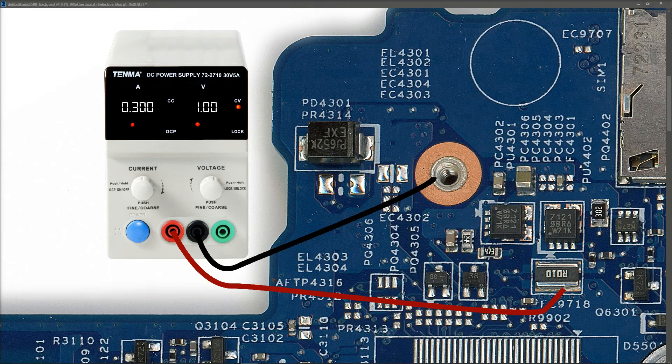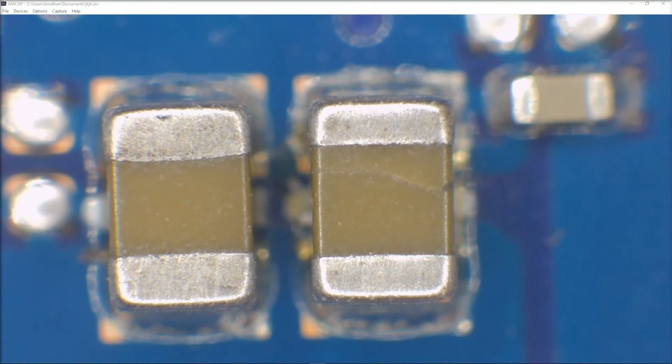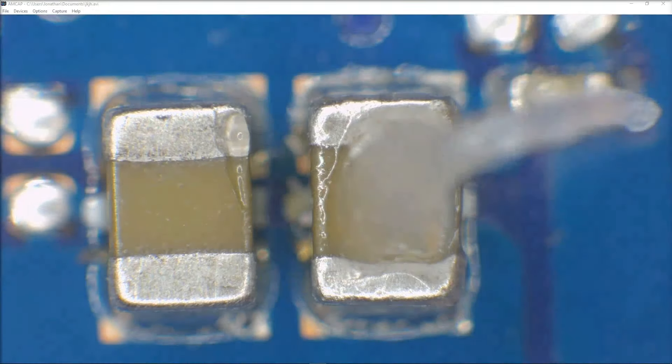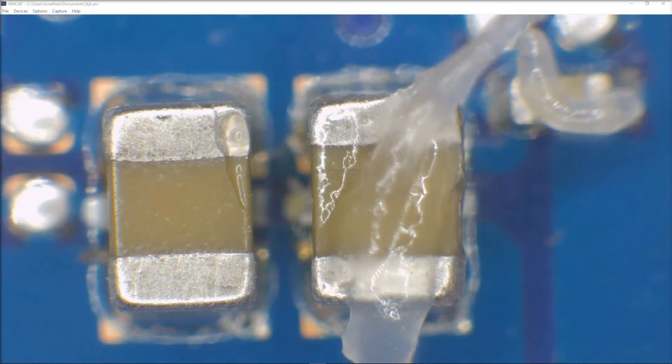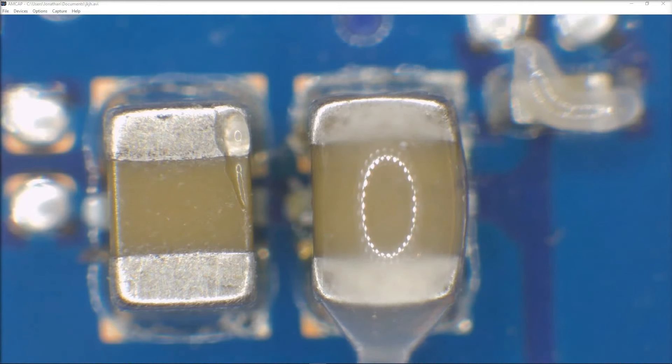When injecting that very small amount of power nothing heated up, so I slowly raised it bit by bit. When I injected 4 volts it drew a current of 1300 milliamps and one section of the board began heating up. At 4 volts, pulling 1300 milliamps, this is the component that heated up. Zoomed in, we can see it also fails a visual inspection - it looks cracked. Just to prove it, I doused it in flux and switched power on again - immediately it starts to burn off the flux. That is our shorted component.